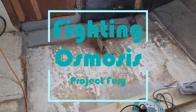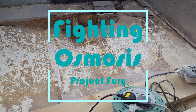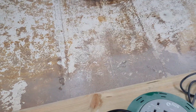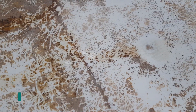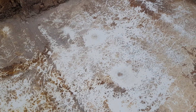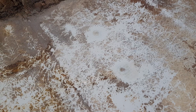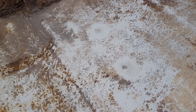Okay folks, I've done a whole load of sanding — about half an hour of sanding. I've got some of this up, but in bringing it up I have uncovered yet more of a problem. You may see some liquid here. We've followed the trail of the liquid up to this hole — we have through-hull osmosis, folks, in several spots. These were just two conspicuous bumps which I thought were just bad layup, and of course they were bad layup, and the bad layup has led to the osmosis.